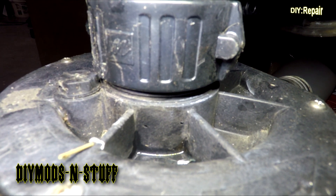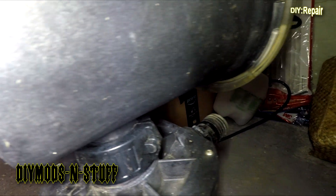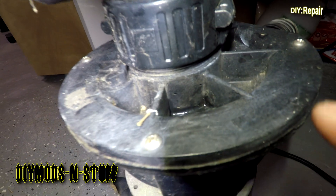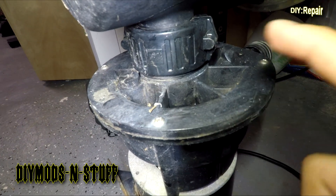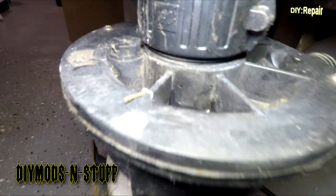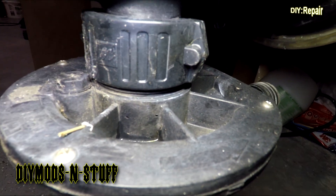Because the pump is working perfectly well, I'm gonna sand that area down and use the JB Weld Marine. Hopefully that fixes it. I believe this is a replaceable part, but let me give it a shot first — you always go with the most cost-effective route. You can see the water coming out from there, so I'm gonna sand it down, clean it with alcohol, pack it in with some JB Weld, and let's see how it works out.